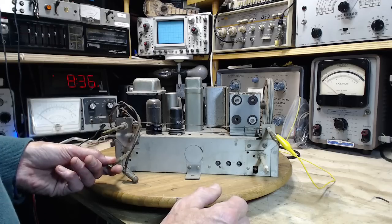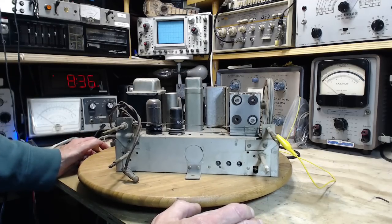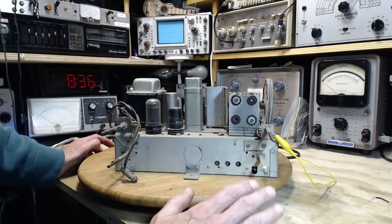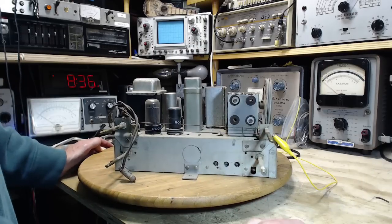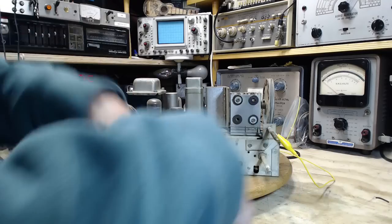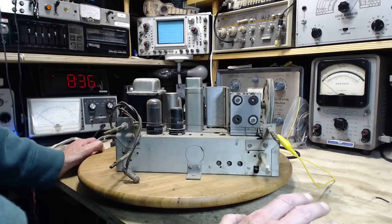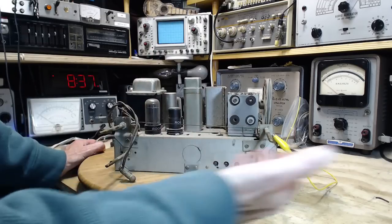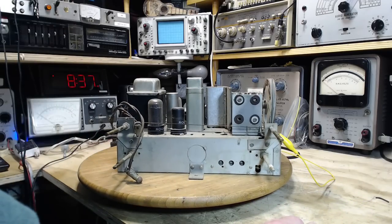So throughout a radio, there are capacitors installed that are designed to short out any RF signals that have gotten onto the wire that the capacitor is attached to. So if you have certain wires that you're worried are going to become antennas or maybe feeding actual radio signals back and forth inside the radio inappropriately, you can quiet them by sticking a capacitor to ground, and then those signals will, you can think of it as going through the capacitor into the chassis. It's not quite accurate, I think, but the effect is the same. Those capacitors get weak, and maybe you can't quiet some of those wires, and the next thing you know, one of them becomes an antenna and picks up all kinds of interference, driving me totally nuts.